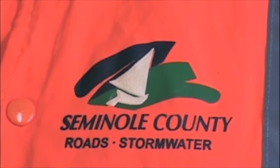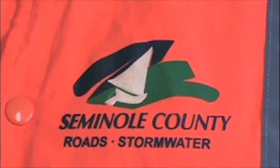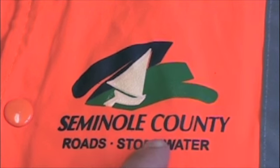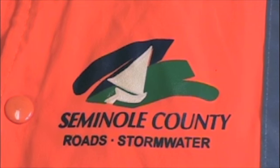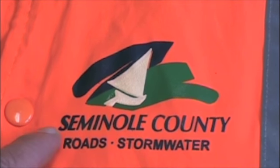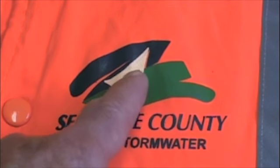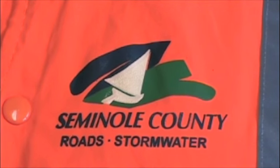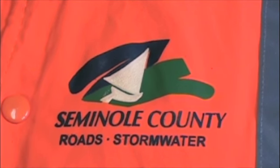The second image looks better than the first, and you'll notice those little dots are missing. The reason they're missing is the customer taped the underside of the screen so the ink cannot leak through the screen. However, when they taped, they also inadvertently taped over the top of the O, so the O does not print completely. And yet you can still see the S is too thick. The image is really not better. It's clearly out of registration. So it's not an acceptable print, and another expensive jacket was wasted.